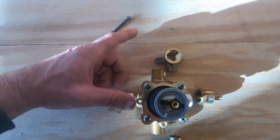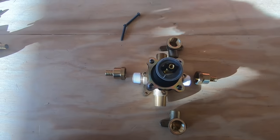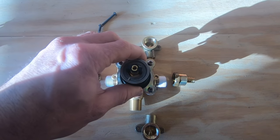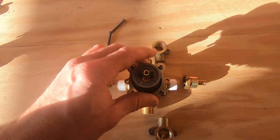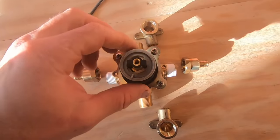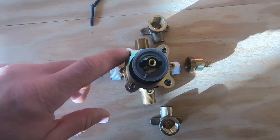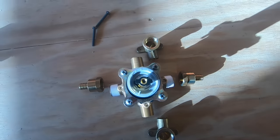What I'm going to do is take all of these valves — the inside parts out — that way when I solder, none of this will get damaged. This cartridge is what actually controls the balance of your hot and cold water. You have to take out these four screws and then that whole assembly just pops out. So that's what we're going to do now.